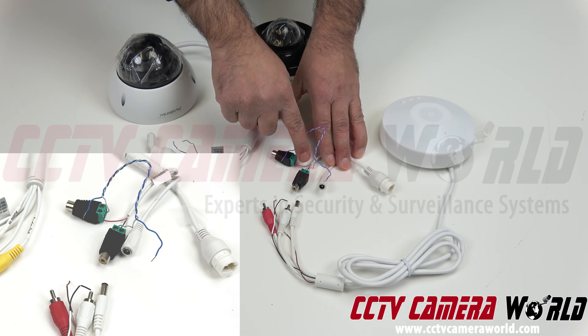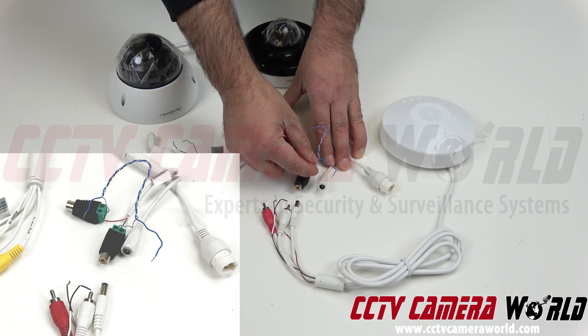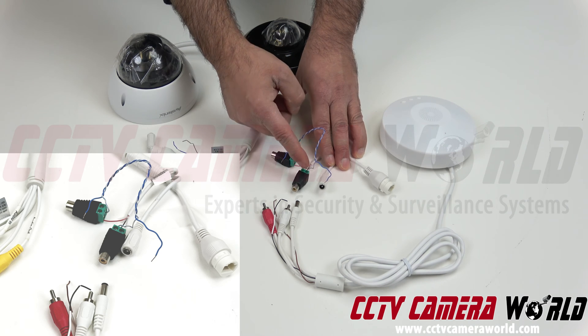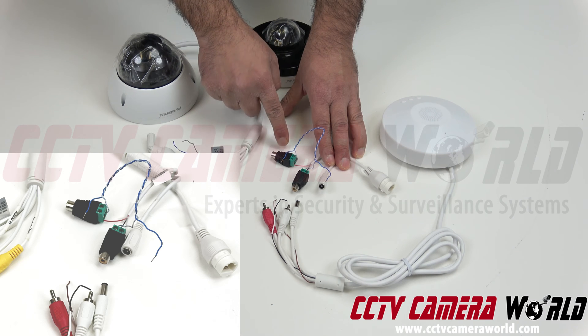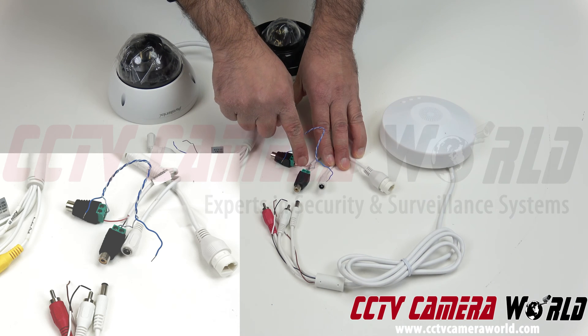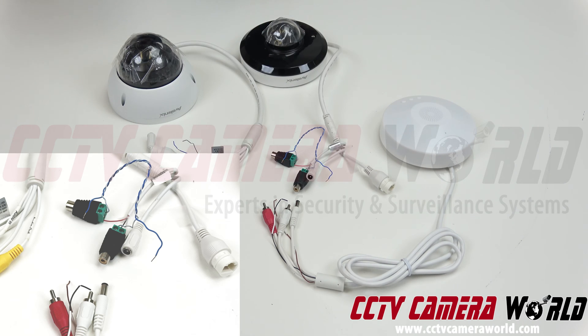Black is ground. I chose to connect it to my audio in and then I used a little piece of thin wire — this is a Cat5e solid copper, bare copper solid conductor — and then bridge the ground on the negative on one terminal to the other. This allows you to properly set up a two-way audio input into this camera.